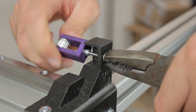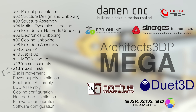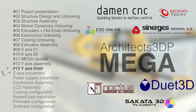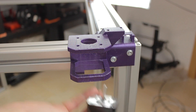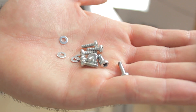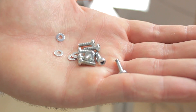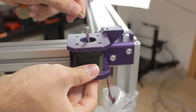That's from where we're going to continue today. In episode 13 we are going to finish the build of the Y-axis and plan the next steps. The first thing we're going to do is jump to the back of the Mega and install the two NEMA 17 stepper motors that are going to power the axis. They are going to be installed from the bottom using some washers and M3 by 10 millimeter bolts.